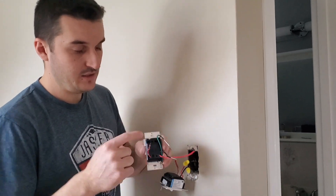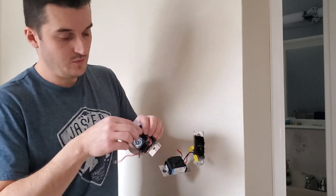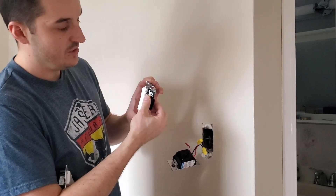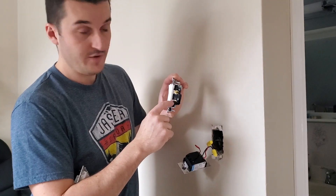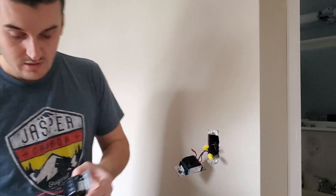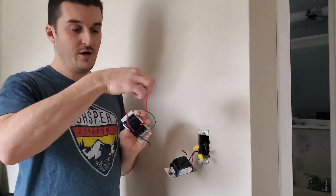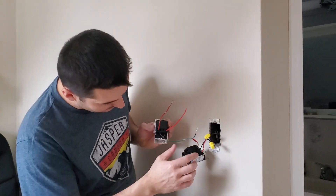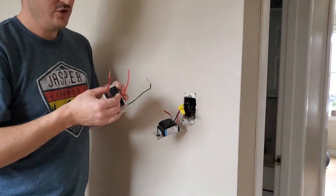The way you find out what wire connects to what — here it's very straightforward because I only have two, so we'll just match up the colors. But on this switch, let's say you pull out your switch from the wall and you have three terminals with three wires going straight to your switch. What you want to make note of is which wire goes to the black terminal, called the common terminal. Often on your switch it'll be a different color, so mark that wire and make note of it. When you remove it, that common wire will go on your new switch with the black wire. The other two — it doesn't matter which you marette — they'll go to the other terminals. And if your switch comes with a green or bare ground wire, you'll want to attach that to the screw in the back of the box. Do that one first, make sure it's nice and tight, then do your other two or three connections.